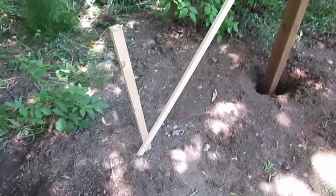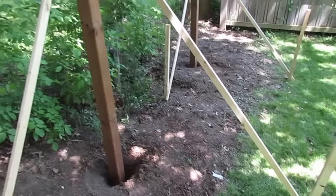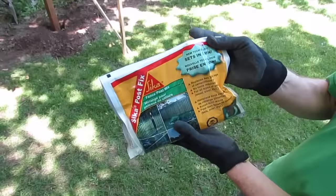Here we're looking at the portion of fence I'm installing, and we can see that the holes have already been augured. The posts are in place — they are standard 4x4 pressure treated, and they are staked and braced to keep things level and straight throughout the day.